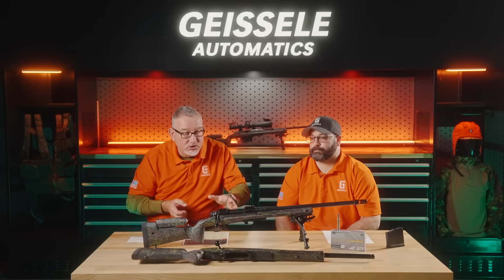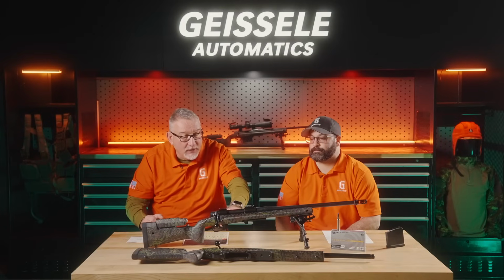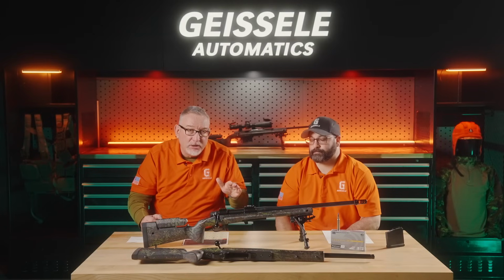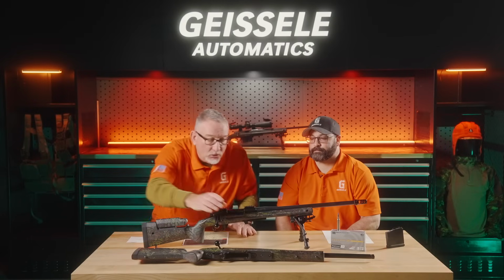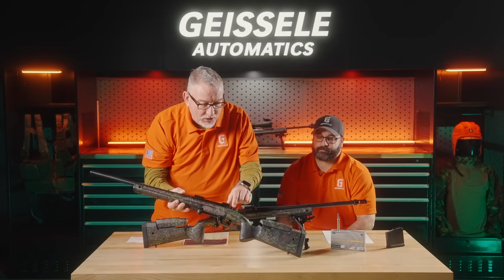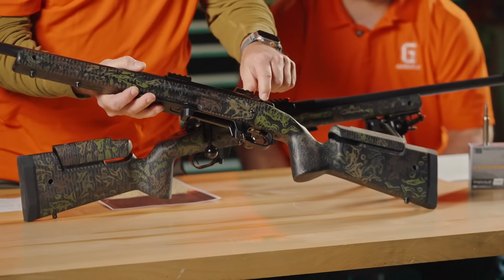That's what we chose. It's machined out of a solid block of stainless. The Picatinnies on top are integral. They're machined into it. The recoil lug is machined integral into the receiver. It has a bolt stop here on this side. You'll notice kind of like a standard feature of standard PRS guns, very heavy duty and easy to manipulate bolt stop.